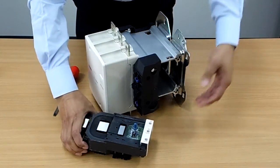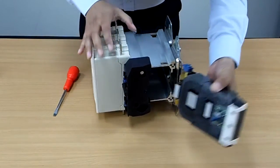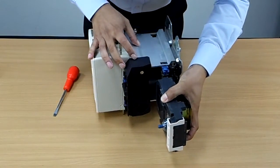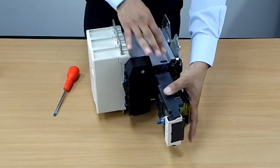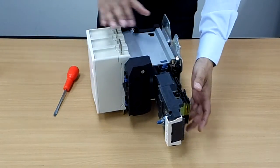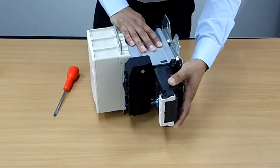To put the coil back into the contactor, just lift, turn to the side, and put it in the slots just here. You might need to depress just gently on the blue tab and there we are — that's held it in place. So at this point you can just gently push in and you'll feel it start to slide in and fit into the slots.